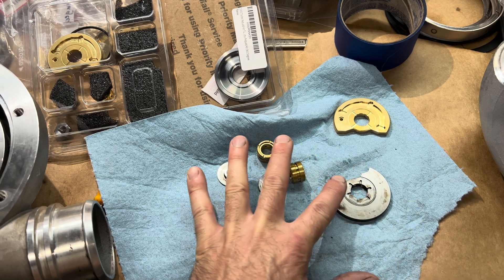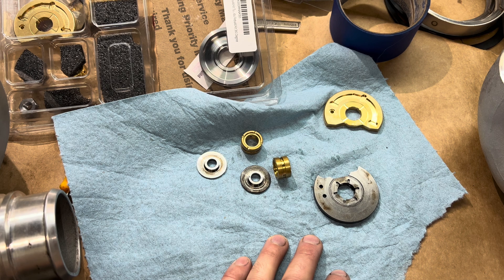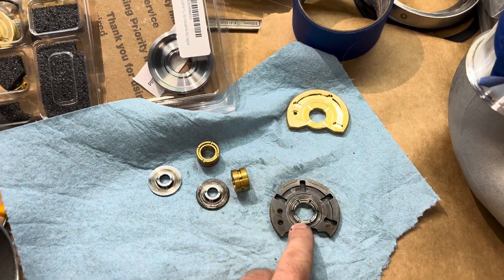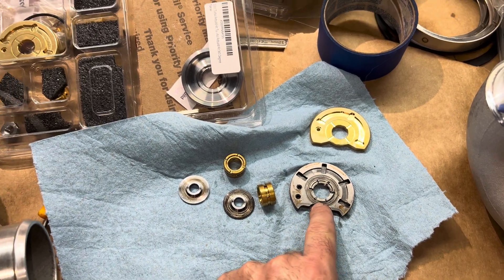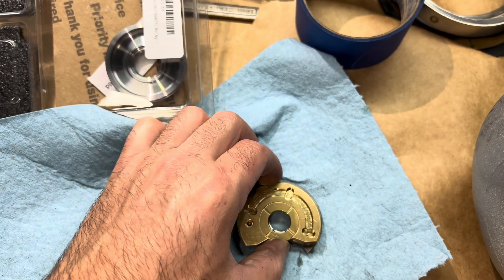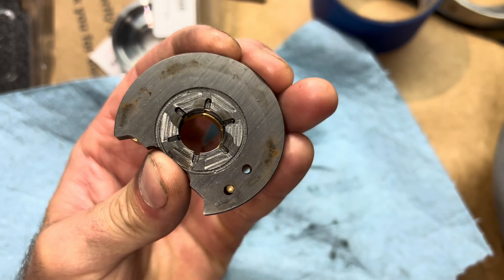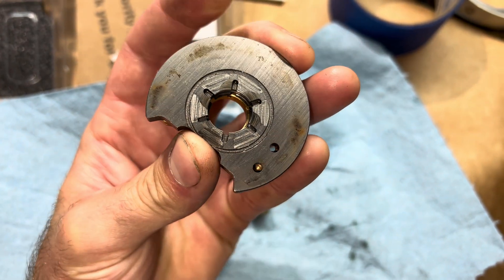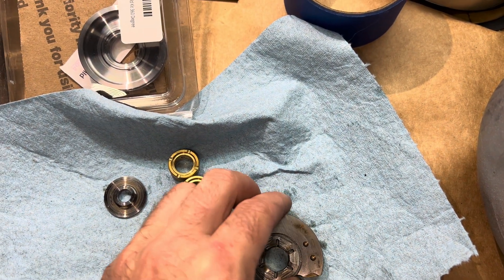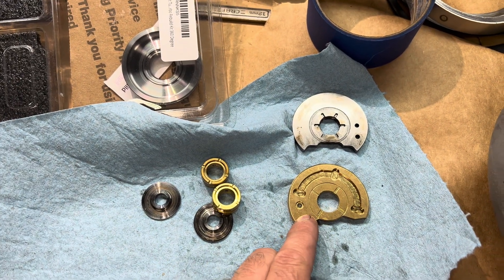This is original, and this is what you need to make this right. There is some modification necessary because it's not quite the same as what needs to be here. What needs to make this fit inside their bearing housing is it's got an extra pin hole here. You'll have to line it up and run a drill through there to make an alignment pin for this to work in their bearing housing.